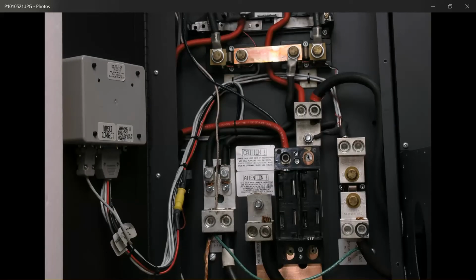We're taking that out of there. We're getting rid of these guys. Here's our battery. There's our PV output. And PV negative is going to be right up in there with the battery negative, like here. I'm sorry, here, if you're going to keep this stuff in play. And this cable removed, and yeah, we're changing up where we're taking the negative off of there and putting it down here, so it's all flowing through this shunt and should be good to go.